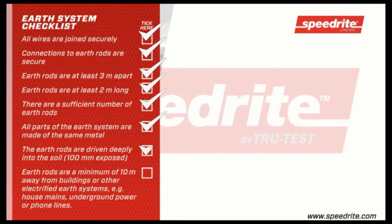The earth rods are driven deeply into the soil, leaving 100 millimetres exposed. The earth rods are a minimum of 10 metres away from buildings or other electrified earth systems, e.g. house mains, underground power or phone lines.